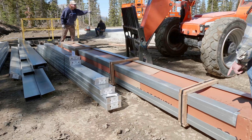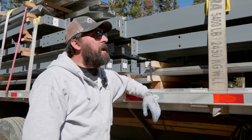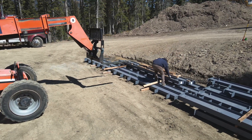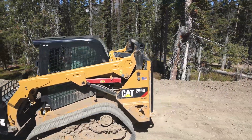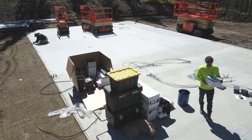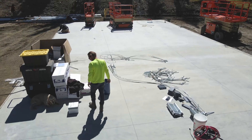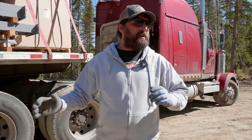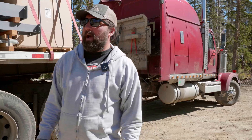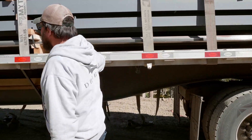Panels and trim will be mostly out of our work area. We'll start to stage the gray iron and the purlins — purlins and gray iron will be going up at the same time. We'll get the warehouse box off and get it on the slab so we can break into it, because we're going to need hardware out of that pretty quick. We'll probably also package up the mastics, sealants, and stuff we won't need until we're sheeting, and get those out of the work area.